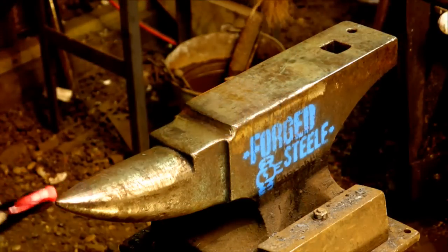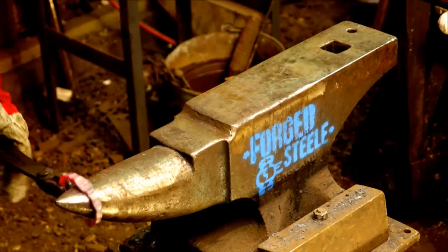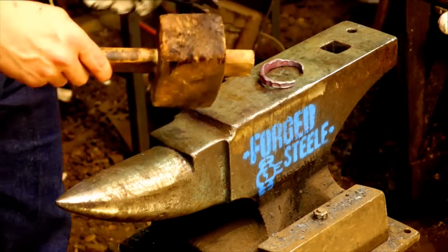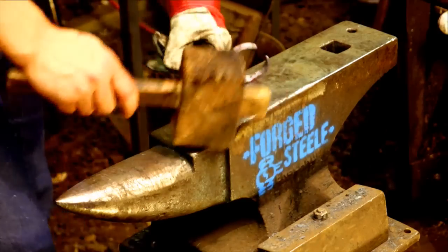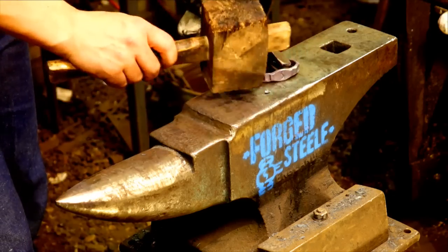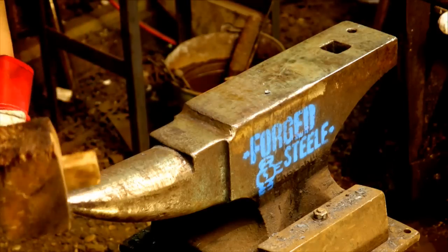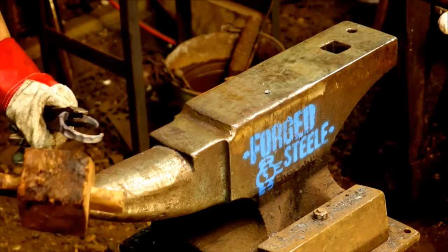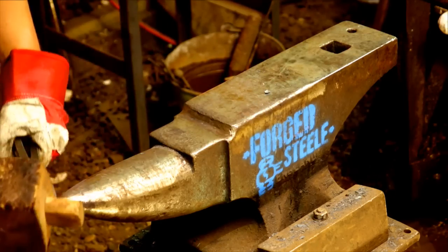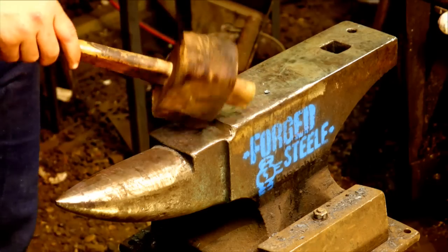The first forge was in the backyard. It was a pile of bricks on the ground with a lilo pump, a pump used for pumping up an inflatable boat, used as my air source to the charcoal. I don't know why I wouldn't have just used a hairdryer. That heated up the lumpwood charcoal and I was able to forge for the first time. I think that is one of the better ways of getting your introduction to forging without an instructor. You take a pile of bricks, same way I demonstrated in my online course that teaches people how to start blacksmithing. You lay them in the ground, a little better than I did first in the course. From the comfort of your own home, you can start forging with simply a block of steel as an anvil.